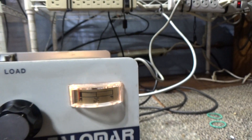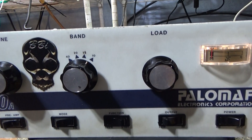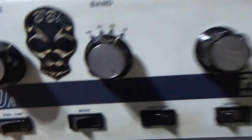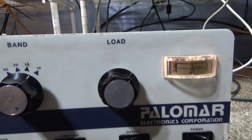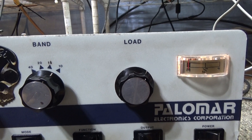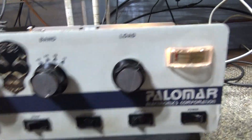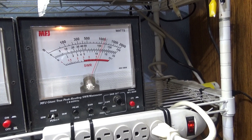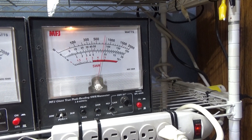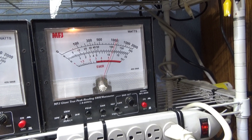We stuck that in there for the guy. Decent amp once you mod it all up and get it working correctly, and don't try to get too much out of it. It's basically called the 90A because it's a little 90-watt amplifier. We're going to use the Mudduck radio over there, key it down — on the 200-watt scale, it must be on peak. We're dead-keying 30 watts, and swinging to about 120 watts peak with audio.